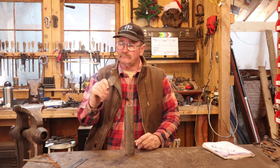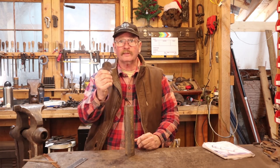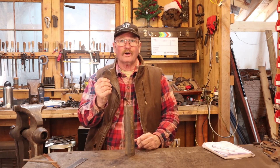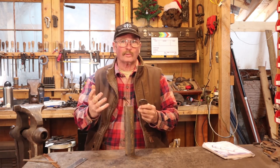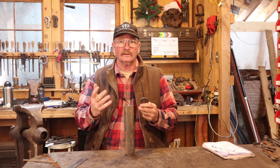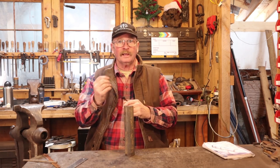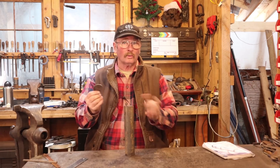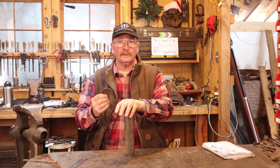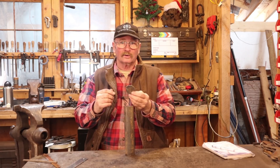I have cut about an eighth inch thick disc off the end of it just to have a little bit to play with. We're going to go to the forge and harden this possibly three different ways. If we hit on one that gives us a good hard piece of steel, then we're done. We're going to start off by heating it up to a nice orange temperature. I don't know what the right critical temperature for this would be, so that's just a starting point — a good guess. And we're going to let it air cool.